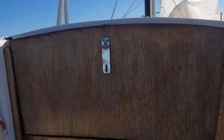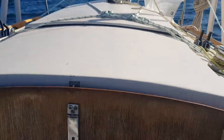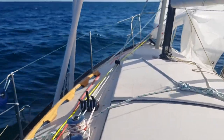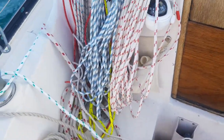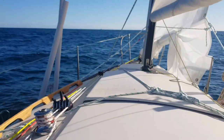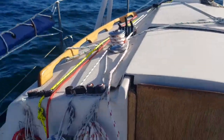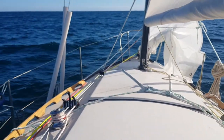While we're here — I know the jib could be tidied up a bit better at the front there, but there are a couple of reef tack lines coming back to the cockpit. So when I want to shake that jib out, all I've got to do is undo those reefing lines at the front, ease that tack off, pull up the halyard, trim that sail on again, and we're good to go. I'll see if I can film that a bit later.